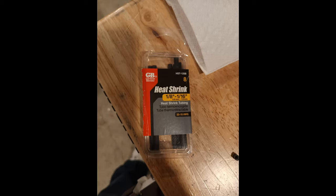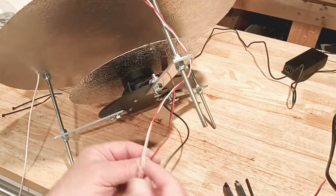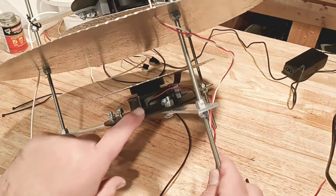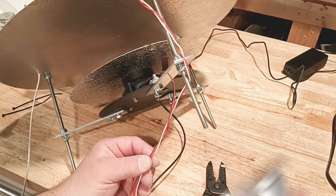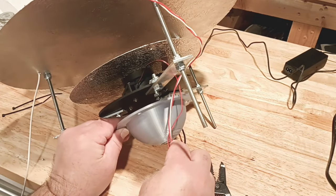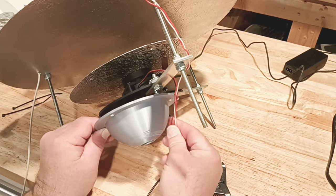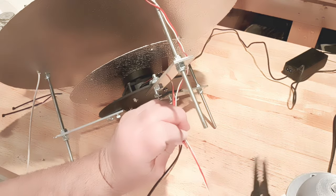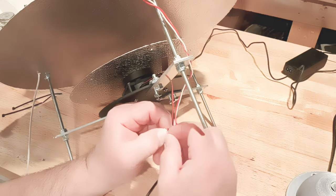Two other items I used: here's the shrink tube I used today, and here is the piezoelectric disc. I'll leave links in the description for everything. Now that everything on the top is done, let's go ahead and move on to the bottom portion of this. We're going to get our other motor hooked up now. These are the two wires that came from our motor on the top. We're going to go ahead and splice this wire in and connect these two motors to it as well. I know some of you may want to run individual motors — that's fine, just add another wire here and connect those motors right down to your driver. So you'll have to have two drivers; I'm only going to run one.